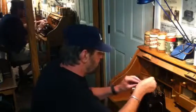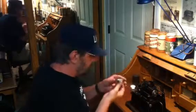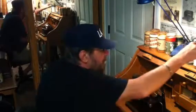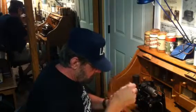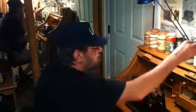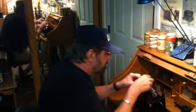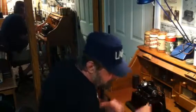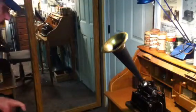So it's going to be interesting to see what kind of recording that made on the GEM. We got SWARF — so if we got decent SWARF, we got a decent recording. Let's pull the cylinder off and blow the SWARF away. Always interesting to record on a different machine than you usually record on. So let's install a C Reproducer, install the cylinder, give it another couple of winds. All right, let's see how we did. The Solo Cup Recorder recording on the GEM.